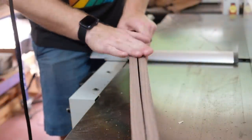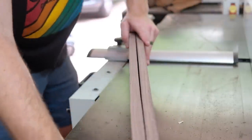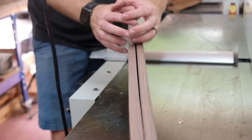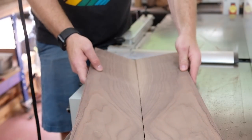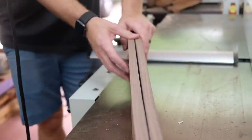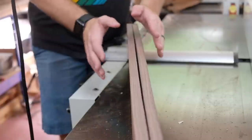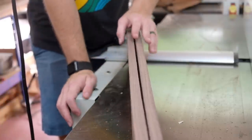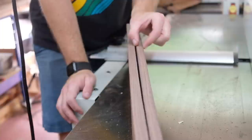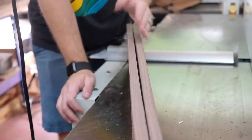So this was a test piece, although I will be using it for dividers — I didn't want to do a test on my actual case pieces. You can see that I resaw it in half, but both ends are touching and then you have this eighth inch gap in the middle. So that's the tension that was released as I cut the board in half. Walnut and some other species are notorious for that. I used some quartersawn sapele in my last project and that went much easier — there was no cupping or twisting when I resaw those boards. So that's just something to be on the lookout for when you're using different types of wood. You're going to have to joint this board now and it's curved, so you're going to have to make sure you leave enough thickness that you can joint and plane that down to your final thickness while getting rid of that bowing.